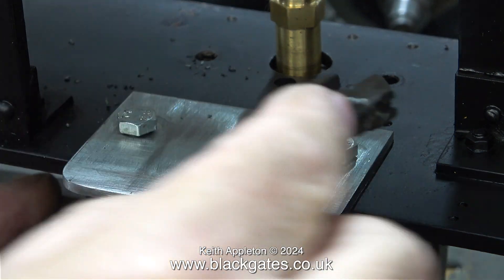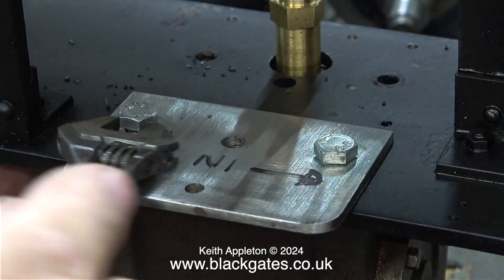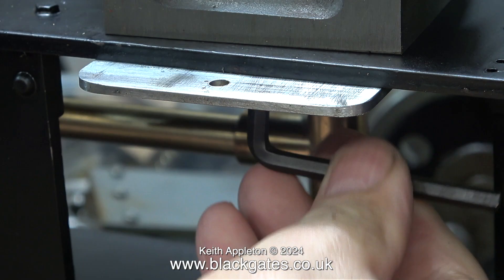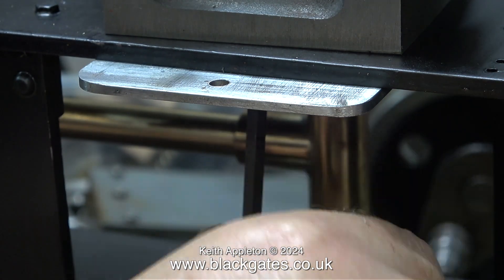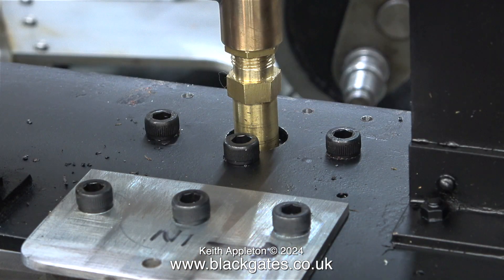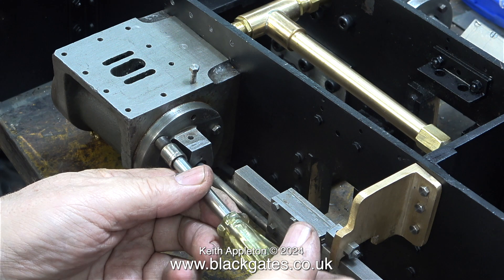What I'm doing here is repeating the process on the other cylinder. First I remove the two temporary bolts and replace them with allen cap heads. For this job it's far easier to use an allen key than a large spanner that you have to keep repositioning as you tighten. In this clip I'm fitting the centre bolt of the other cylinder. With all of the allen cap head bolts in position I really don't think the cylinders are going to come loose. I was a bit concerned the brackets might not be in alignment, but I refitted the piece of 3/16ths bar and everything was fine.